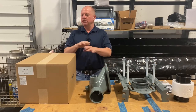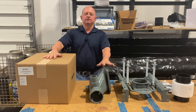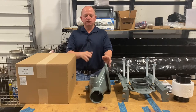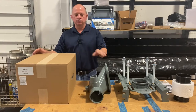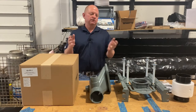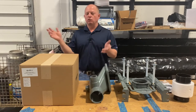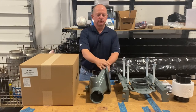Another nice thing about the Watts closet carriers is they're basically two pieces — you're going to get a fitting and you're going to get a box. That's it. The only other part you'd get is if this was a back-to-back fitting, you'd get two boxes, because you're hanging two toilets. There's no separate box for the nipple kit, so where you're hauling like four boxes out for one carrier, you're going to get a box and a fitting.